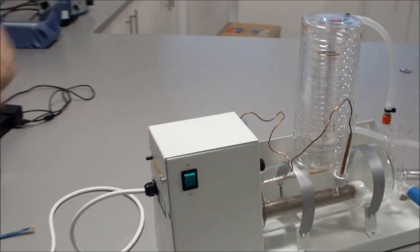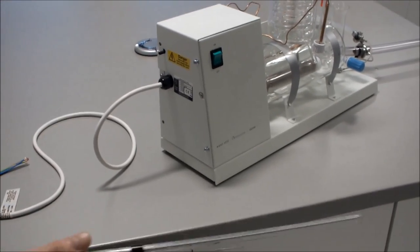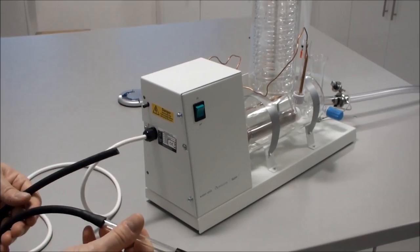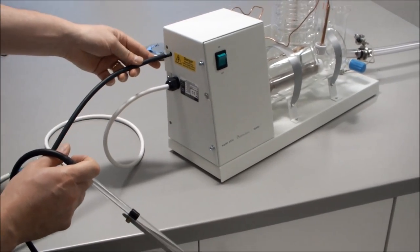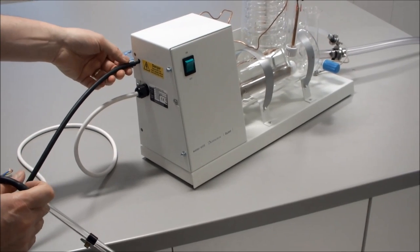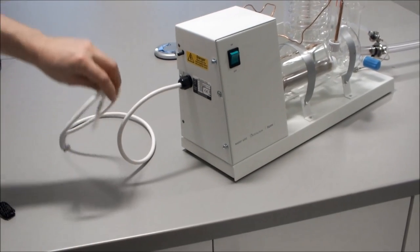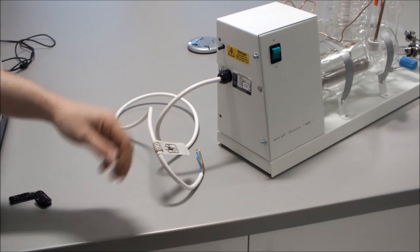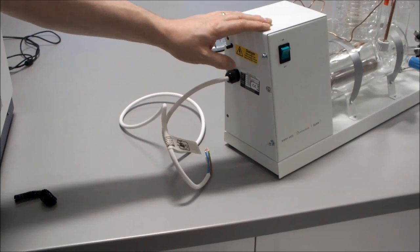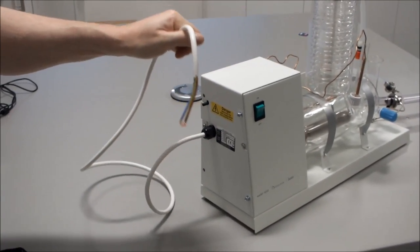After the leak check, connect the reservoir water level sensor — consisting of a black hose with a glass bell that goes into the reservoir, with the tubing connecting to the pressure switch. That's finished. You can then connect the electrics, which must be done only by a qualified electrician. This is a permanently connected unit, so it needs to be permanently connected to the mains — not via a plug.